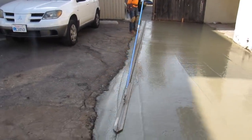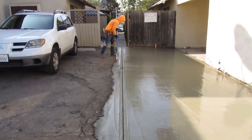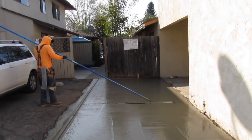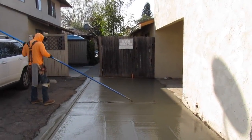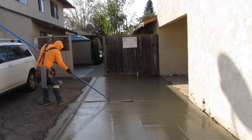Those are the joints we're cutting where they're going to saw-cut with the walk-behind when they do the parking lot. From that joint that Daniel's putting over there is the property of this building's owner, so right where we put the joint they can saw-cut on it.